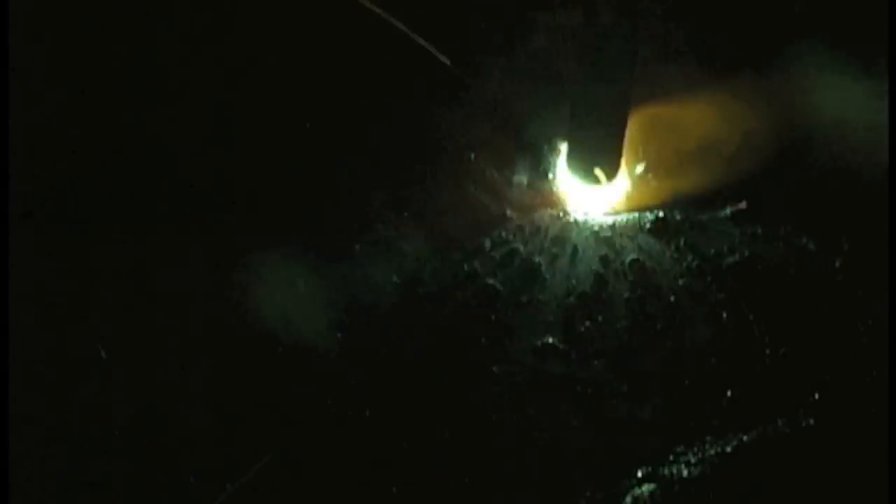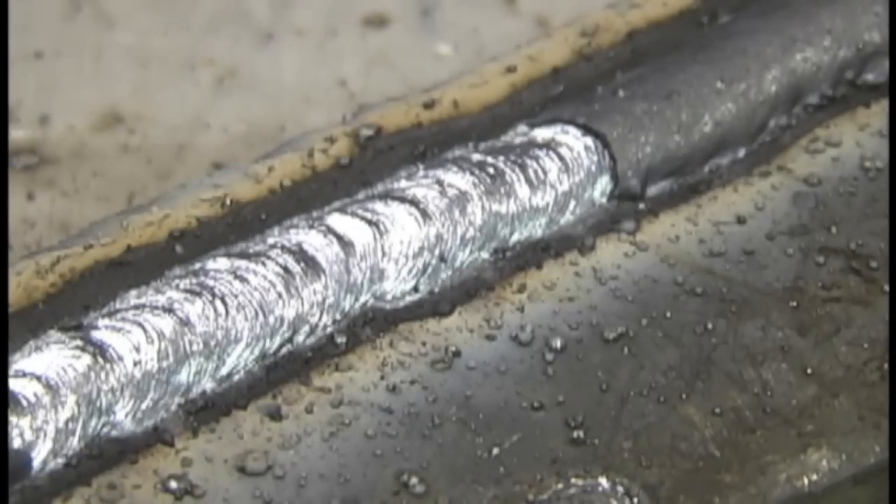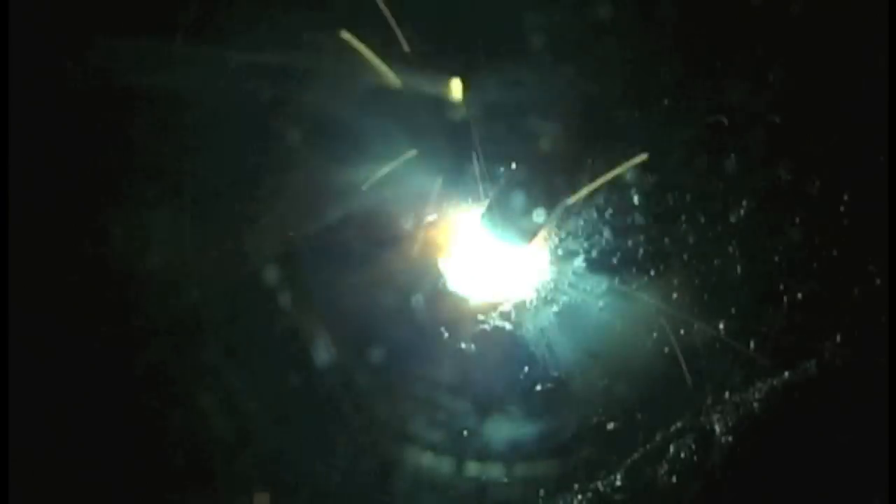Let's get back to padding the beads the right way. I'm set at about 150 amps. I'm not really sure how accurate this machine is — it's been through a couple of floods, never taken apart and cleaned — so it seems like it might only need maybe 135 or even 105 amps, but 150 here is working pretty good, so I'm just using what works. Each machine is going to be a little bit different. AC is going to be a little bit different than DC, but the main thing is you get that bead flowing good, not too hot not too cold, and the counselor will advise the scout on what's a good setting.